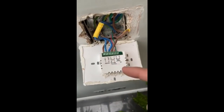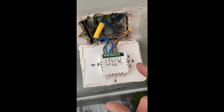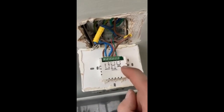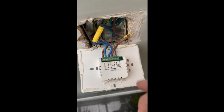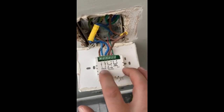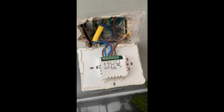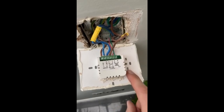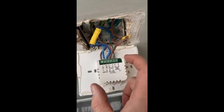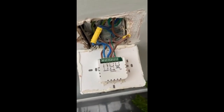When it comes to changing over and installing a new one, here's a top tip: take a picture beforehand before you start undoing these terminals. When you come to fit the new one, the sensor wiring may be arranged differently or configured ever so slightly differently. I've found that with a few different underfloor heating thermostat manufacturers the way they do these is all a bit different. So take a quick snap of what's existing — you know it works in that configuration — and it'll make fitting the new one so much simpler.